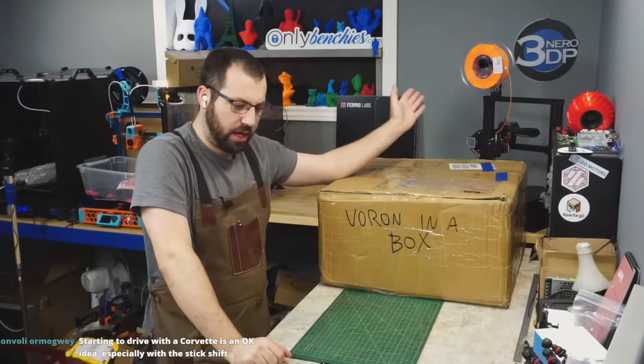These are not lubed. What I recommend is if you have something like an ultrasonic bath, take your rails, put the carriages at the end, and just stick them all in your ultrasonic bath in a baggie filled with ISO or whatever cleaner of your choice. Apparently, don't use Simple Green. It discolors some rails, not all of them, but some. I think it's Simple Green HD. I use ISO. And you put it in a baggie, that way you don't got to fill up the whole thing with ISO and turn the room into a bomb.